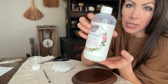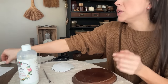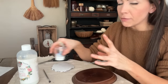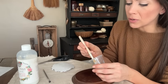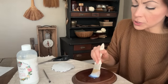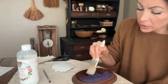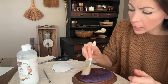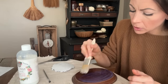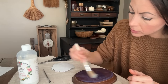I've really been enjoying this Sweet Pickens Top Coat for a decoupage medium. It's very, very matte - it's my favorite top coat out of everything I carry. So just using a chip brush here and I'm gonna do one light coat over the entire oval front just so all of it has the same matte finish, even though my decoupage paper doesn't necessarily cover the whole piece.